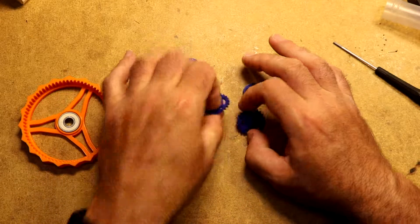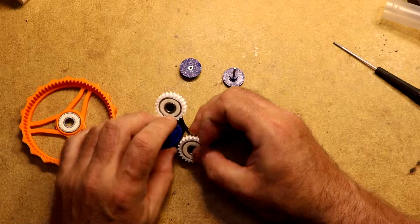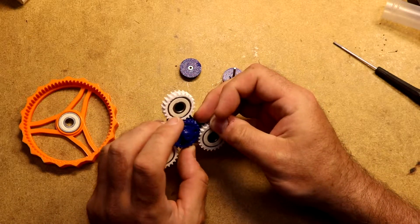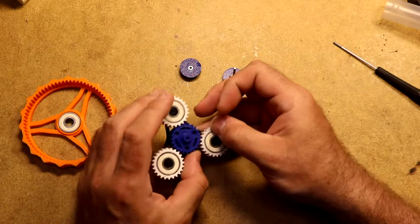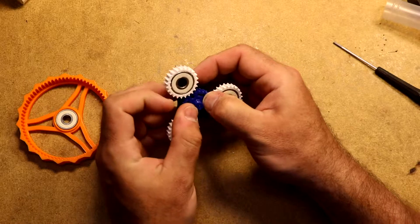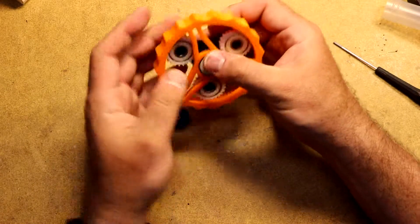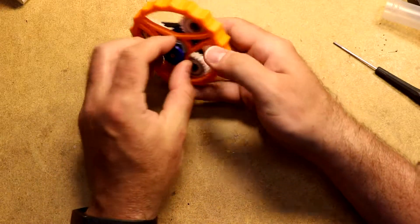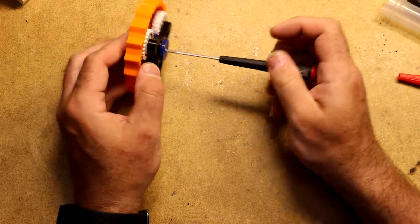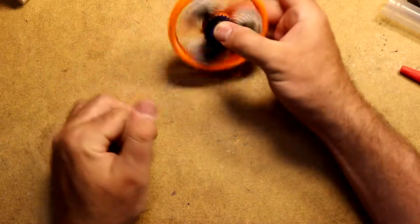So it's relatively easy to assemble this again. You don't even have to use the pins to hold these two pieces together because the bolt will hold them in place. Let me get this put together, lined up straight, assemble this, make sure it's rotating smoothly, put the end cap on, and then tighten it up with our M2.5 wrench. Now it is good and tight and it's not going to come apart.